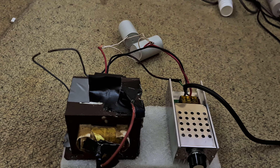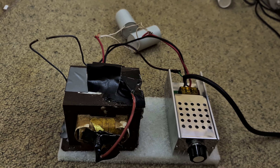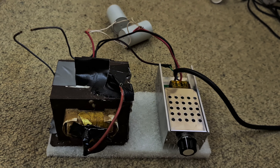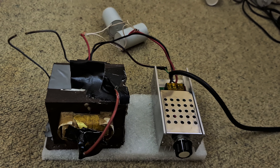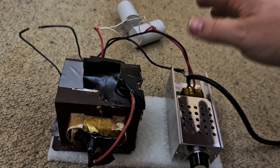Eight to nine millimeters works out to anywhere between 10,000 to 30,000 volts depending on humidity and what you read. I don't have a way of exactly measuring it, but effectively this replaces a whole bunch of microwave oven transformers in series plus an extra transformer as a ballast. And with these capacitors, just by changing them, you change the ballast.